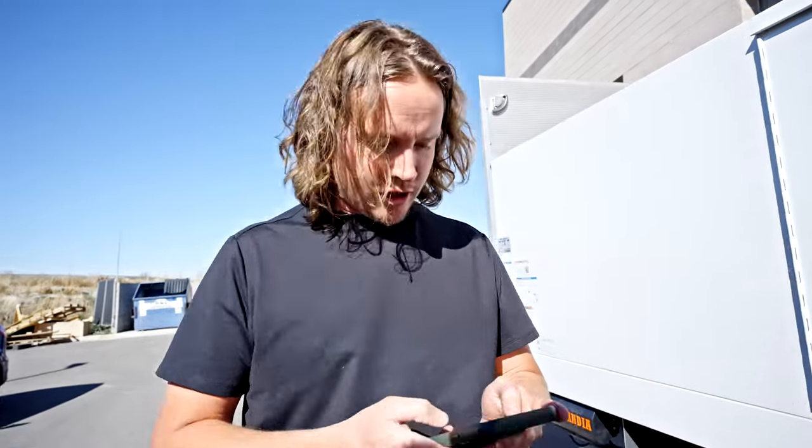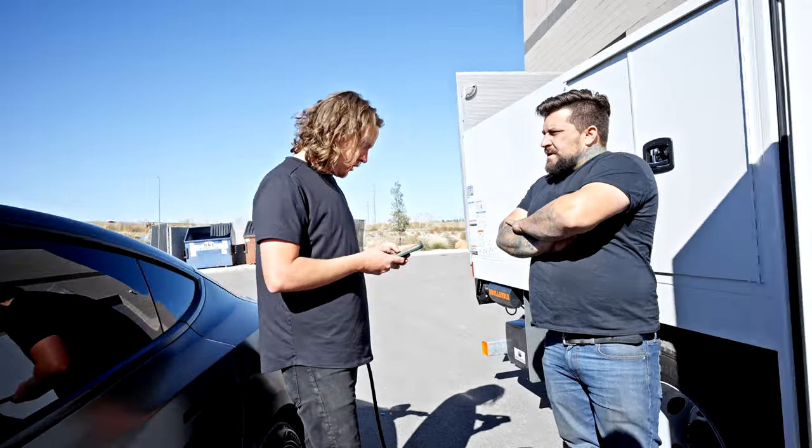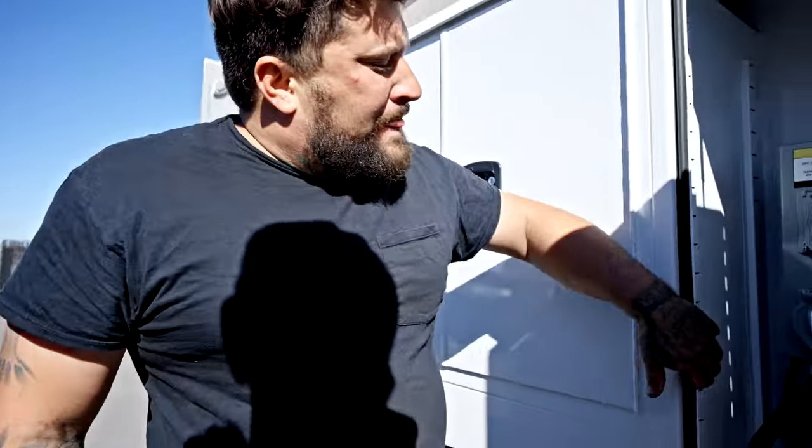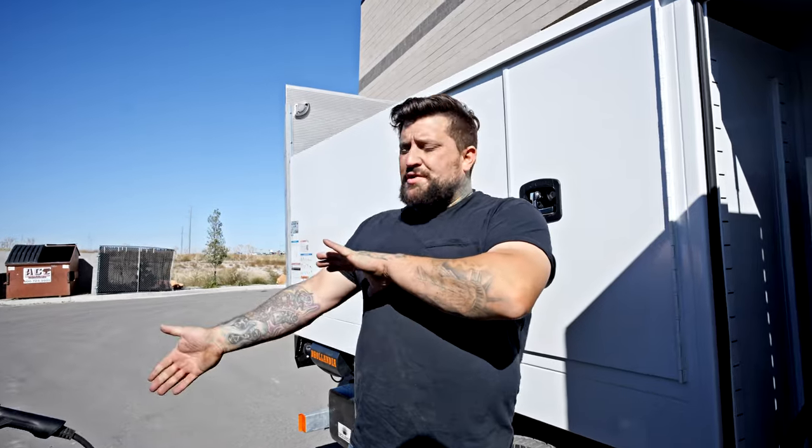Alright. So we are charging currently at 32 amps, 238 volts. If we had the other charger plugged in, that would have done 40 amps. This circuit I'm tied into is just our baby 30 amp single phase. So we have the big dogs, and we could always increase that circuit. Those are our three phase circuits, for big things.